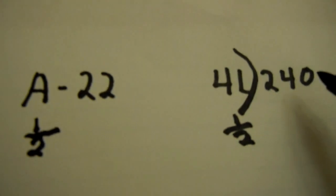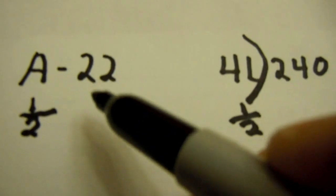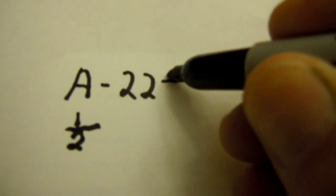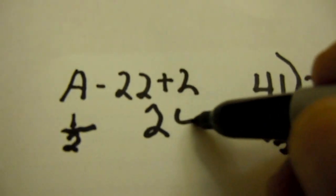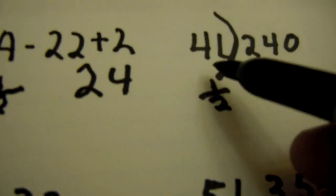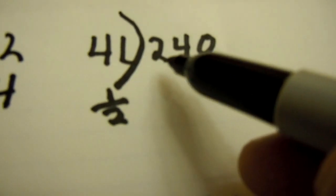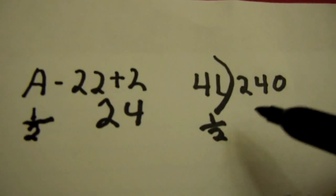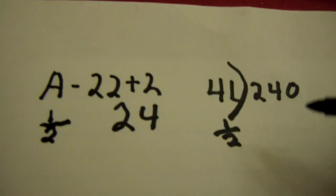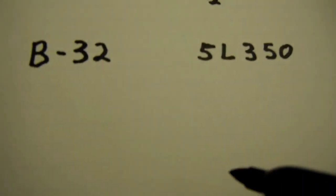How do you get 22 to 240? All you do is take the 22 and add 2. So 22 plus 2 is 24, and that means this is a 240. That's how you can calculate this — you don't really need a cross-reference book for these belts. You just have to do a little math.